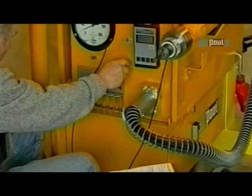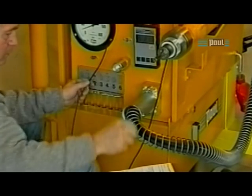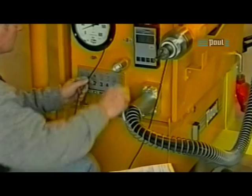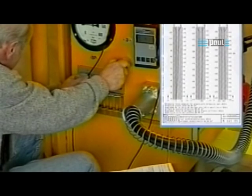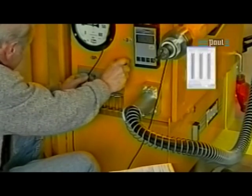Three series of measurements are made at different piston settings. Loading is in 50 bar steps. At each loading step, the manometer reading in bar and the force measurement reading in kilonewtons are noted. After the results are evaluated, a test certificate is issued. A stressing force diagram is drawn after a successful inspection, and the oil pressure is then set according to these values.